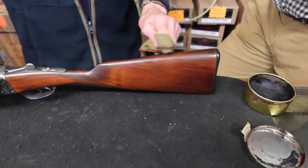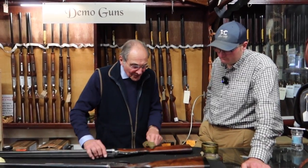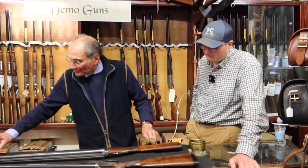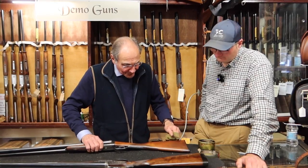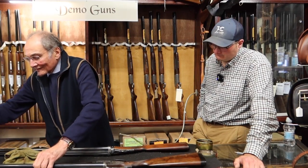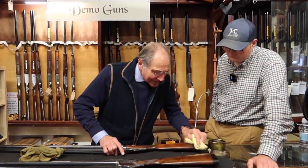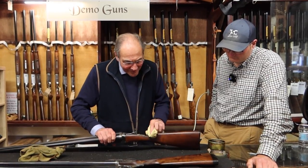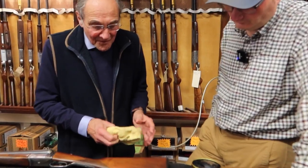The more you polish it, the better it gets? Well, it's about building up the layers of wax, not just effort. Being beeswax, it's a very natural product and it just builds up over a period of time. Just get a nice rubbing like that, then leave it a little bit to dry. And you can see how that's started to come up already — and that is a very plain piece of wood.